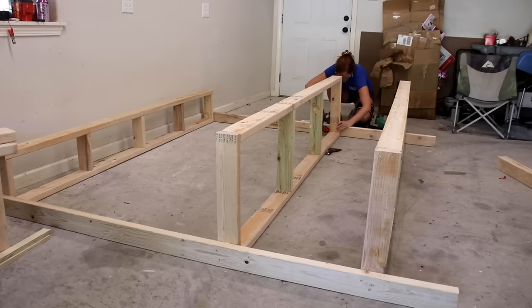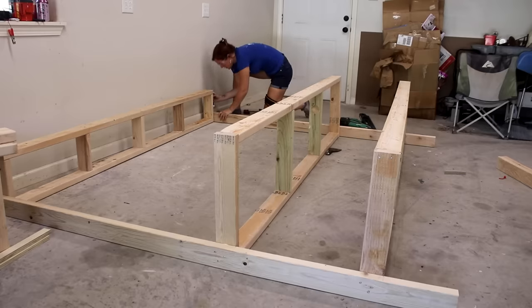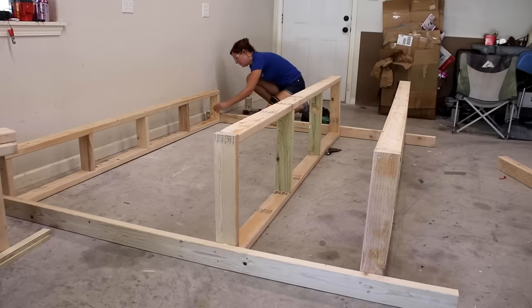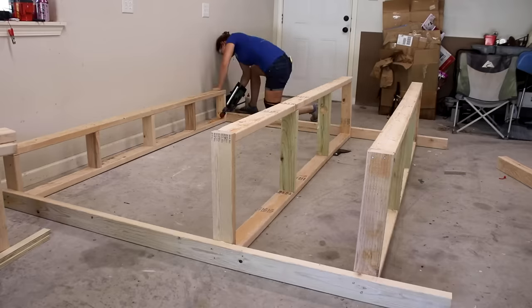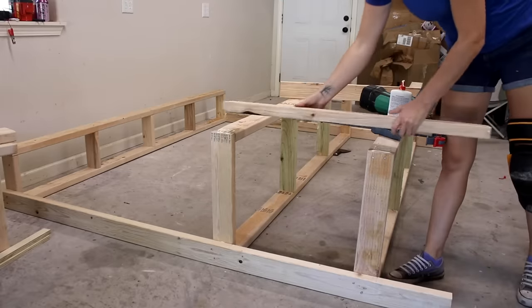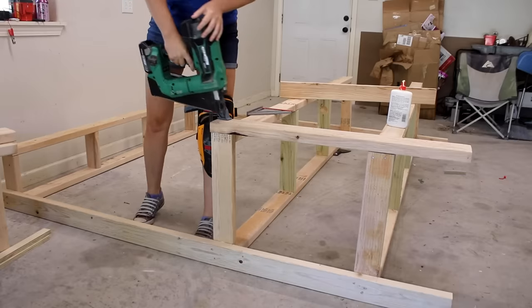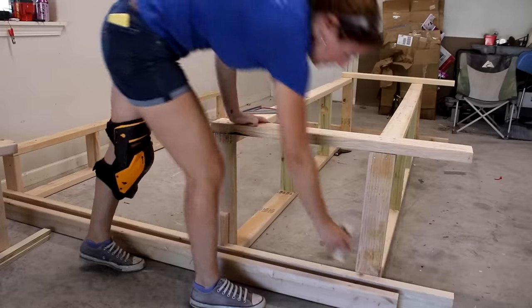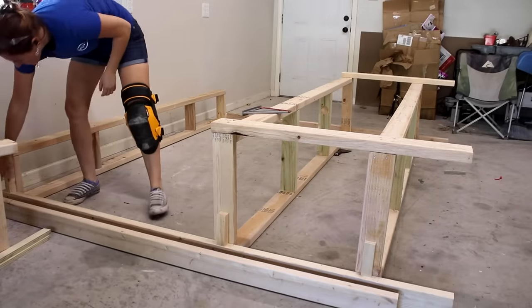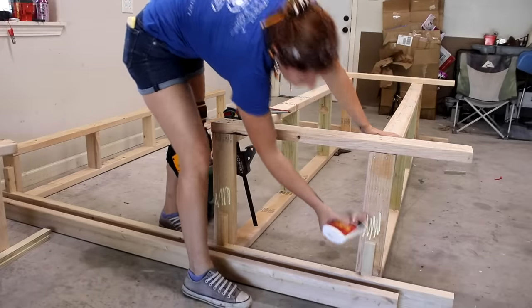Since I'm not working with gravity but instead shooting in sideways, I added a clamp to each joint before adding my nails. This will keep both boards completely flush to each other instead of the impact of the nail slightly pushing the backboard away. After repeating on the other side with the second back leg, I moved to the front and attached both of the front short legs. Don't forget I have a free set of plans for this build linked below. I grabbed a few scraps and used them as spacers so they act as a standoff for me to set my next board in place after I put down some glue.